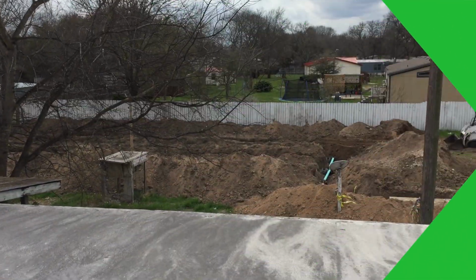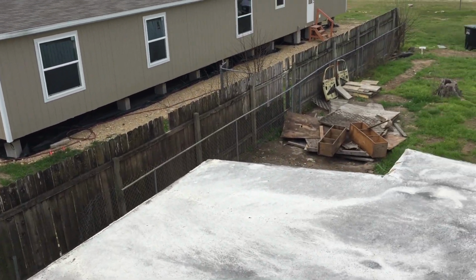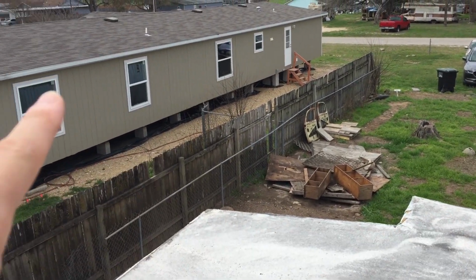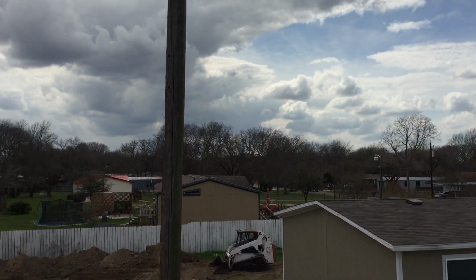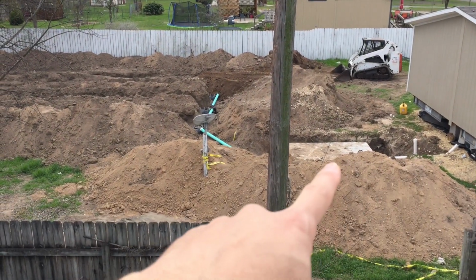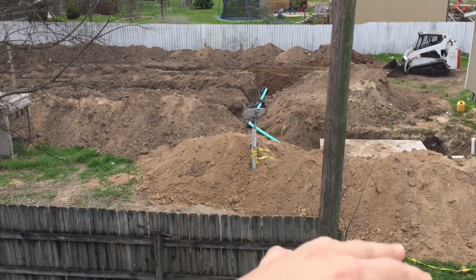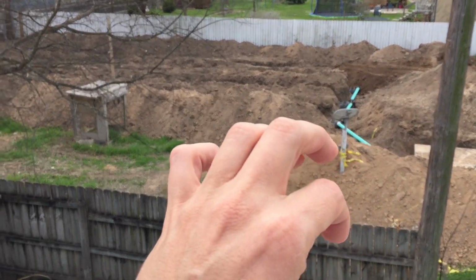I wanted to give you a quick lesson. The next door neighbor, who actually owns both of these plots, like me and Carl were saying, owns this plot and owns this plot. This is his double wide, and there's the septic. Ooh, there's the septic tank right there. It comes out of the home, all the wastewater and the waste solids come into here. And then the solids usually sink to the bottom, the bugs eat that and it dissolves.